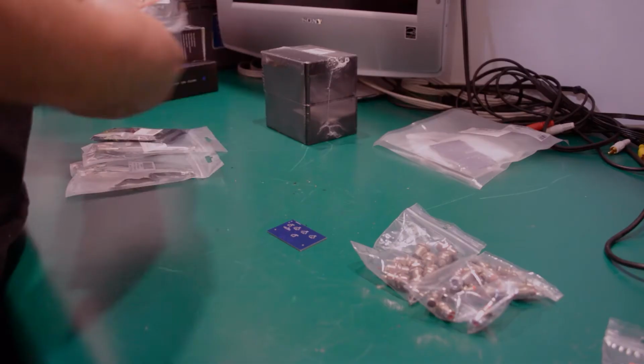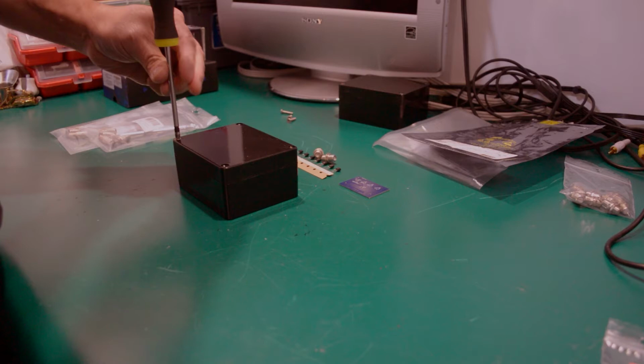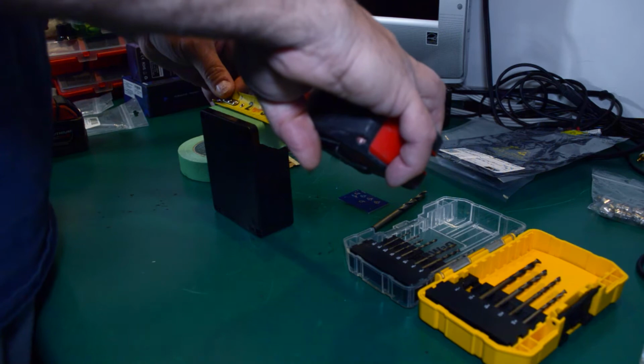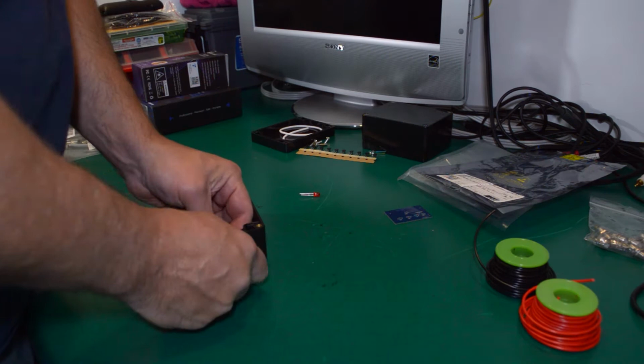I ordered the parts I needed and picked out a small enclosure on the jungle side that had good reviews. It was pretty sturdy and even had a gasket to make it waterproof. I began by taking measurements on the sides to make a hole in the center for the RF connectors that were going to be mounted for the telescopic antennas. Because the case was thick and sturdy, the connector didn't protrude out as much as it should have, so I wanted to make sure the connection was still being made.